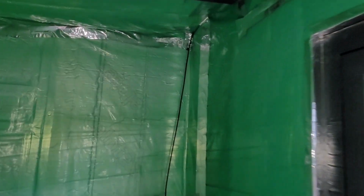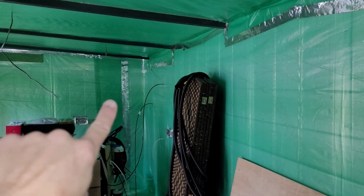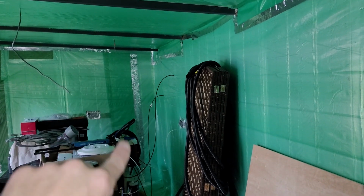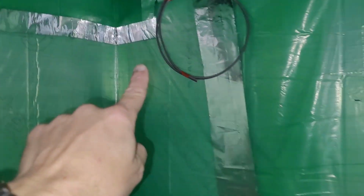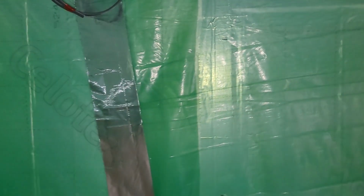Right then, so as you can see, we've got the Vapour Barrier. Let me think. I started on the back wall. So the back wall all the way along, and then you can see where there's a darker patch, it goes all the way to here. And that's all been stapled down, and on the end here I used double-sided sticky tape. So all the way across the back, right up to the corner of the ceiling and wall, and then again round to I think around about here somewhere. So again, double-sided sticky taped that and staples, and then obviously staples all the way down all the timbers.